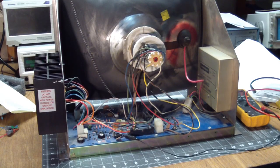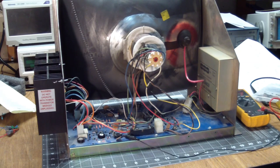I found a replacement transistor. The specs seem to be pretty close. Generally, when you look for a replacement, you want the specs of the replacement ideally to exceed the original. It really wasn't the case here. The replacement I got had a lower frequency response, but it was still in the megahertz. And for switching deflection, that is in the kilohertz. So the change in frequency shouldn't really make a difference. But of course, for the test now, we are set to continuity.